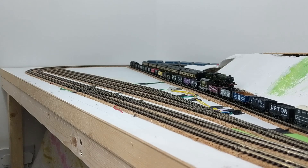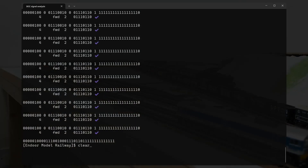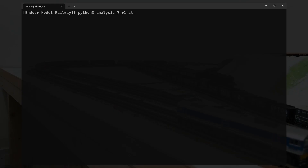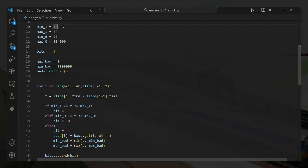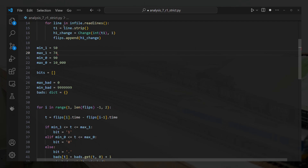On the other hand, I'm not convinced about using MicroPython for this. It took experimentation with several different approaches before I arrived at code that collected numbers that made sense, and I think it's because the code just isn't running fast enough. The values reported aren't all within a valid range according to the DCC specification — if the analysis interprets them strictly, it doesn't produce a single good packet or even a valid preamble. Quite a few are just slightly too short to be a DCC 1 — the 50 and 51 microseconds — and lots are too long, generally well over 64 microseconds and approaching the halfway point between a valid 1 and valid 0, which is 77 microseconds. It's only when I adjust the analysis code to accept all of these as representing a DCC 1 that I get the expected packet information.